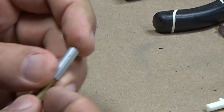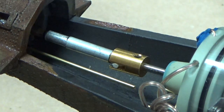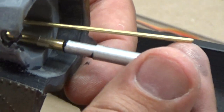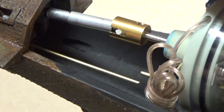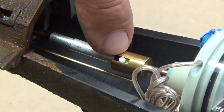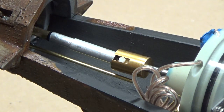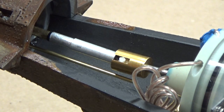Here is the completed adapter — it's just set on the drive shaft loosely right now. I'm going to set it in place, set our coupler on the dog bone, drop the cylinder down where it will sit, and you want this nylon dog bone to sit about halfway in that slot. Once that's done, mark off the location on the drive shaft itself, remove it, secure it with the Loctite, and our drive shaft coupler will be complete.